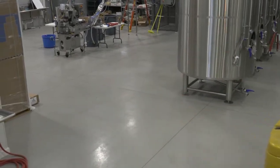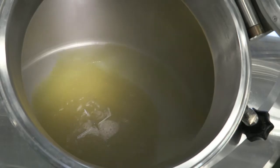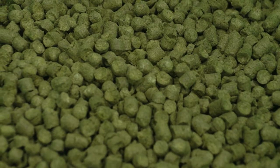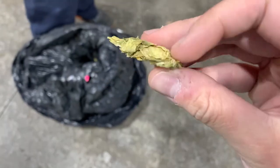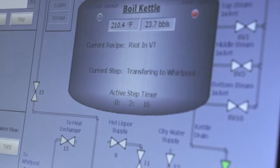After lautering, the boiling process is used to remove excess water and unwanted bacteria from the mixture. The beer is then transferred to the whirlpool tank where hops are added. Hops provide a distinct bitter taste for certain beers like IPAs. They're these little flowers. They look like cones, and they produce lupulin, which makes bitterness and different flavors like that. The whirlpool process also concentrates the beer and removes any excess grains or hops from the mixture.